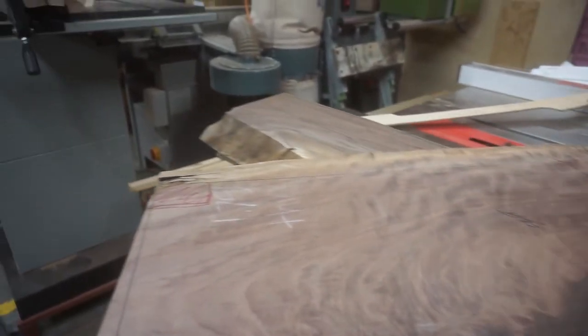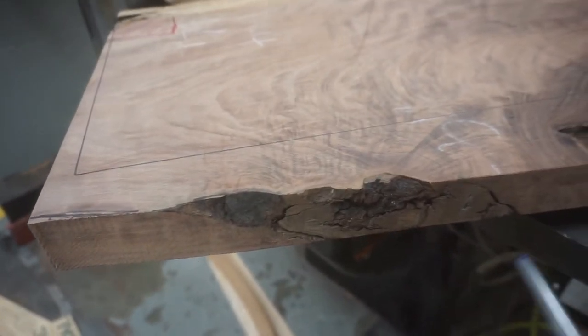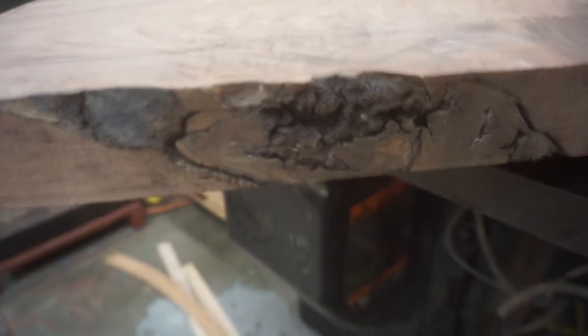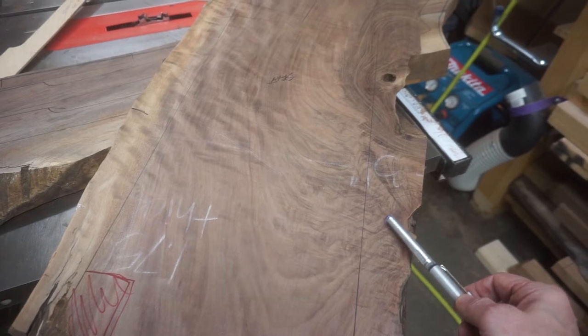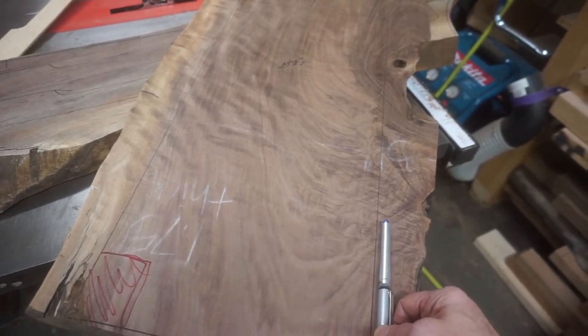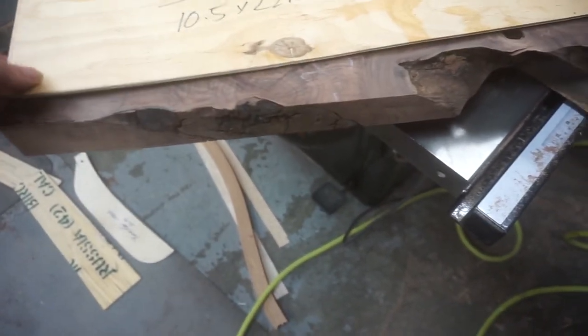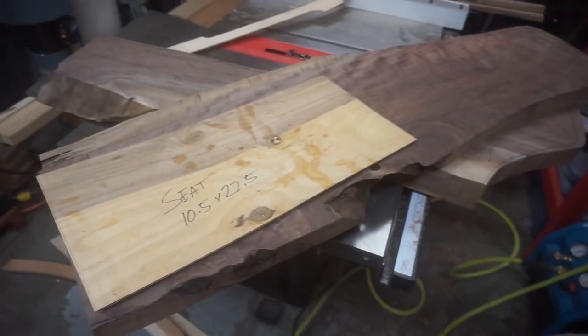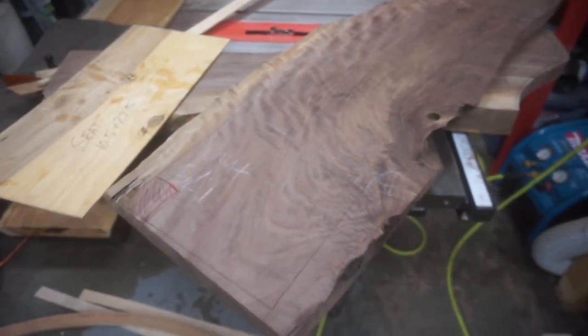This slab is a good example — from the top I could see an inclusion somewhere in here but wasn't entirely sure how deep it went. On the other side I could just see a little inclusion, but it went all the way through and actually went really deep. The fact that I planned the seat to stay away from that outer edge was quite important, because this inclusion probably goes quite a bit deeper. Now that it's a smaller piece, I can just cut this off until I find where the inclusion ends, and then put my seat right up against that.